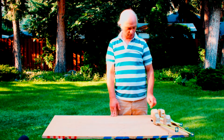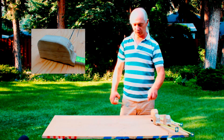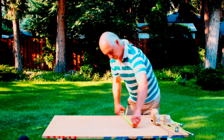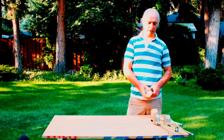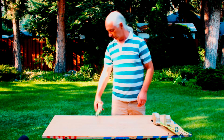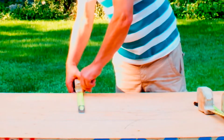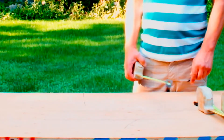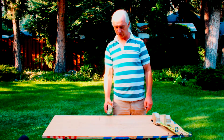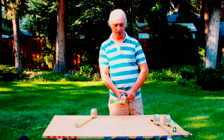I have another body style here — this is a two-spool one which is quite easy to hold onto, with a large end. Another advantage of this design is it could be used as a square in many instances, as you can see the face holds the tape quite firmly. It's not an accurate square, but for cutting out for a window in drywall or a little bit of siding, cutting out for a window, it would work in that case.